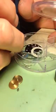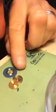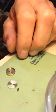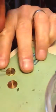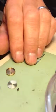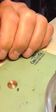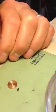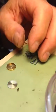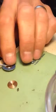I have a mainspring for my Rolex — it comes with a blue side and a silver side, blue side up. When I push it into the barrel, I put a little bit of oil in it. Should be fine. This is tricky — make sure it's flush and push it in.